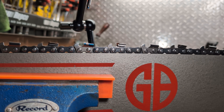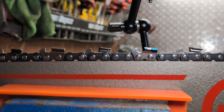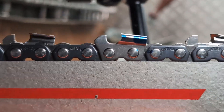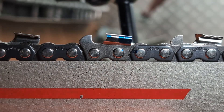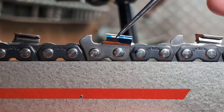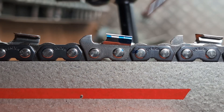From my own general experience, the Carlton theory worked — it's about right. You just need to know how to apply it to the chain that you're using and the style of cutting you're doing. The biggest effect of this comes at the end of life — you'll notice the biggest effect pretty much by the time the chain is approaching that rear rivet. Anywhere from there back is where you'll notice the biggest difference, which is about the last third of a chain's life.